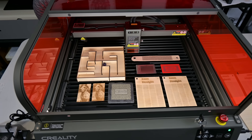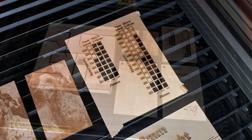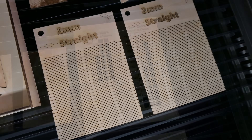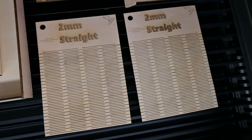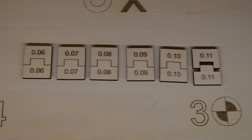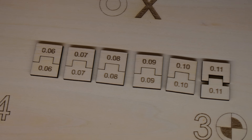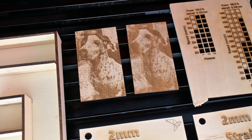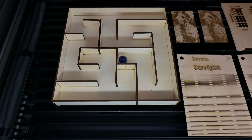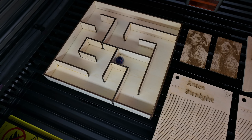The Falcon 2 Pro really shines when cutting wood. The 22-watt laser is extremely powerful, making clean cuts in 3mm plywood at 700mm per minute. The air assist and ventilation do an excellent job making sure even deep engravings are soot-free. I found the ideal kerf offset to be 0.1mm, which is average for this power of laser. This means the diodes are pretty well aligned, but you may not get the most detailed image engravings. For projects that need a lot of cutting, the Falcon 2 Pro shines — cutting out all the pieces for a marble maze was very quick, and everything fit together nicely.